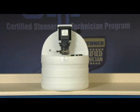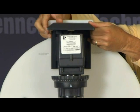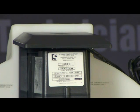Mount the pump vertically with the pump head in a downward position and never with the pump head pointing up, to keep solutions from collecting in the tube housing or seeping into the feed rate control and motor, which can seize the moving parts. With a vertical mount, the rain roof slides onto the mounting bracket to help protect the ventilated motor from water intrusion that can cause motor damage. The rain roof is recommended for outdoor environments and installations subject to washdowns.